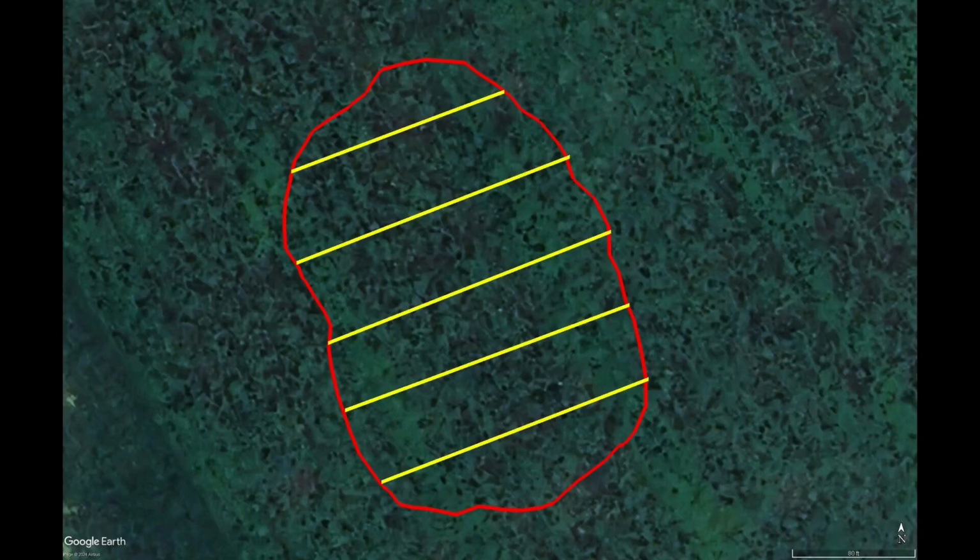John is very systematic about how he places clay and how he compacts this clay in the wetland being built. He uses wooden stakes to mark cells on the ground that are 50 feet wide. He then works to place and compact layers of clay within each cell instead of trying to spread clay over the entire basin. There are many reasons for doing this. It's going to take days to build the wetland, so he can better keep track of the thickness of the clay if the basin is divided into cells.